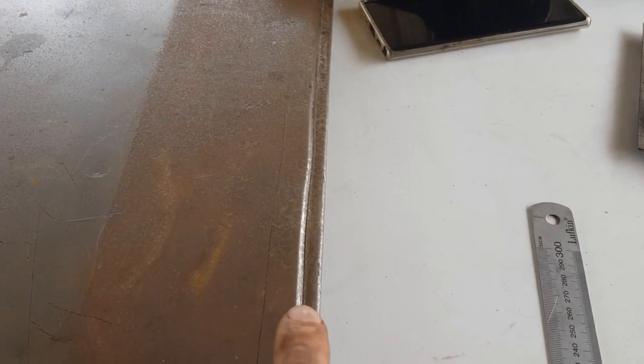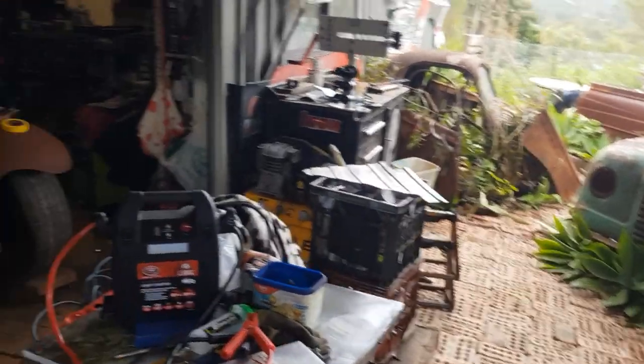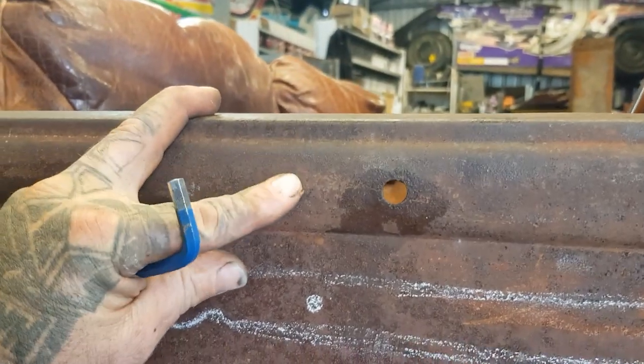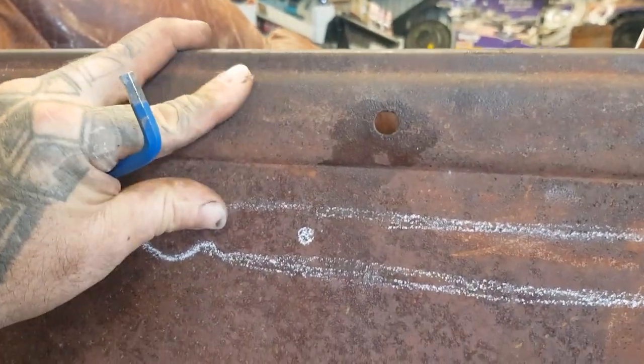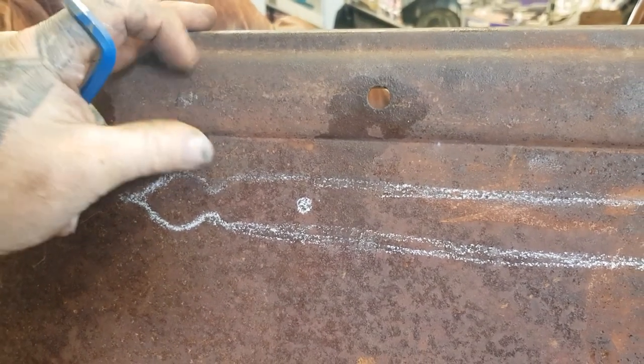So, now, what I was saying was, our fold here is done with the square. It's done with no space, does that make sense? So that's like a square, right? Now what we want is, if we come into the car and have a look, this isn't square, is it? This is slightly rounded, so if we had that just set up as it is, it would come out square and wouldn't quite look right, because that's more like a rounded edge.